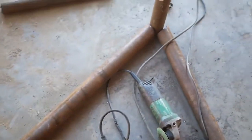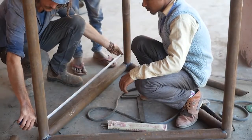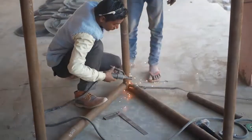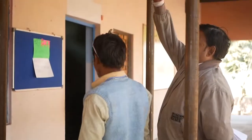To get a triangle, and the triangle that's going to be at the top, lay that down on a flat surface, and then we can weld those pieces together. So you get some piece of pipe that is going to be the same diameter as the pipe that is going to be sitting vertically.